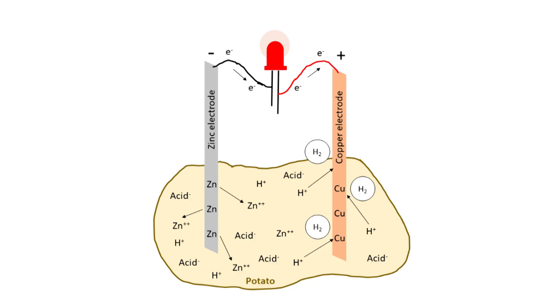Now let's talk about battery chemistry. You don't need to fully understand the chemical reaction to get the basic idea, so don't worry if this diagram scares you. If you do want to read about the chemical reactions in more detail, click the link below the video. The basic concept is that there's a chemical reaction between the metal electrodes, usually copper and zinc, and the electrolyte or the liquid inside the potato. In order for a potential difference to be generated and for current to flow, the electrodes need to be two different metals. If the electrodes are the same metal, then there's no potential difference generated and no current will flow.